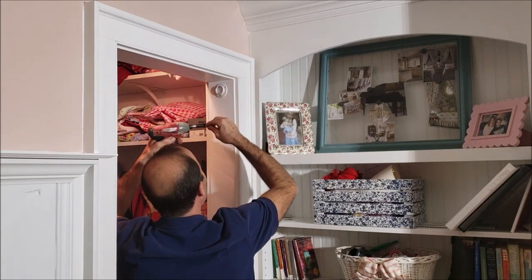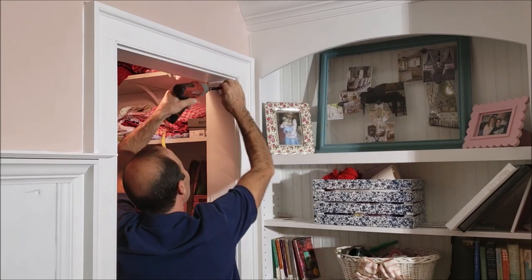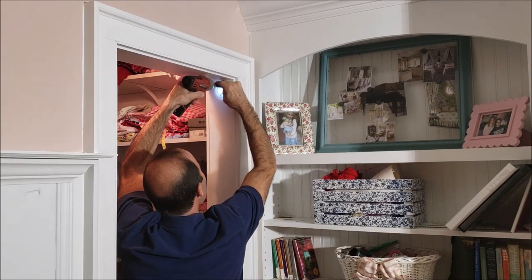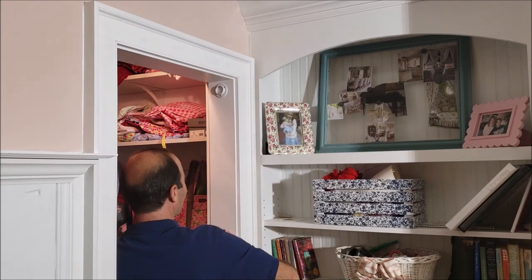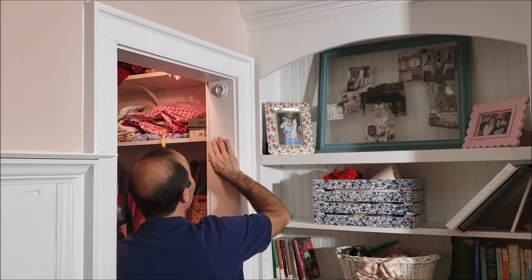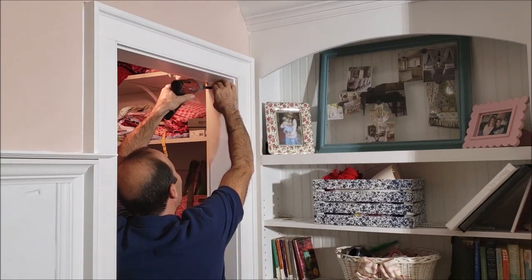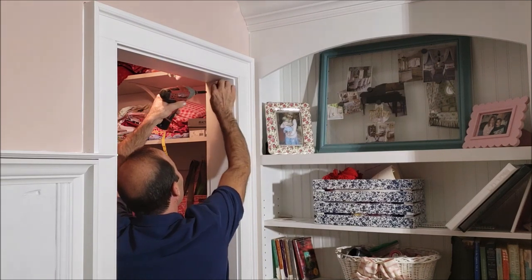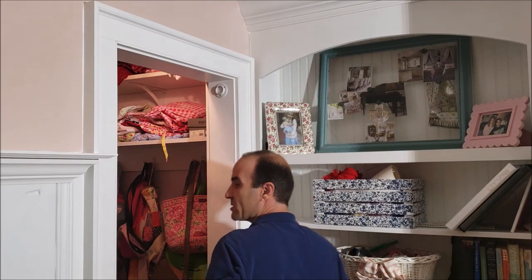Get this oriented straight up and get my drill tip set and we'll attach the rest of them. These are pine boards — finger jointed pine boards. You may have hardwood or MDF, and some of those materials are a little harder, so you might want to pre-drill. In my case I don't need to. We'll mount the other side the same way.